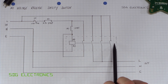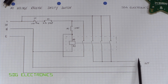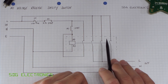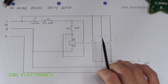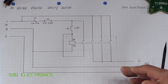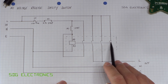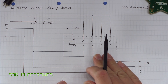We're paralleling up the other three contacts — the live conductor goes through these three sets of contacts to the live conductor out. There is another train of thought whereby you could wire these three sets in series, so that if one contact failed closed, you could still remove power with the emergency stop. However, the likelihood of those getting welded closed is only really going to happen if we're switching very high current items, and this contact is rated for significantly higher current than our 13 amp socket. With the load spread across all three terminals, we're also alleviating the load on any one contact.